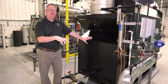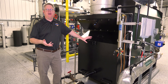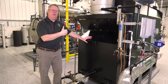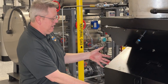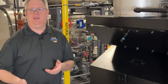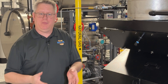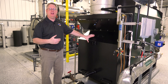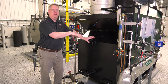If we're looking at replacing the burner on a boiler, one of the questions the manufacturer is going to ask is, what is the back pressure on the vessel? That question really comes into play when we're looking at the fan sizing, because the fan is really just a high volume pump that's pretty weak — but if it's not sized for the correct back pressure, it's not going to move the amount of air we need it to move under the existing conditions.